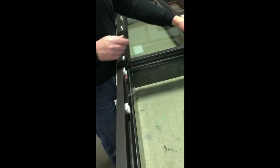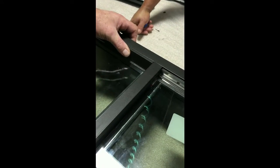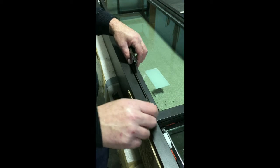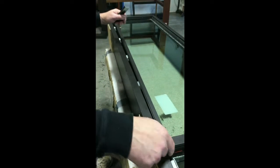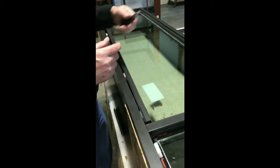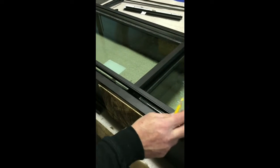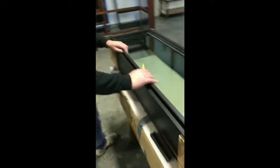This piece is going to go on there like that, and this piece is going to go on here like this. But one thing you've got to watch out for every once in a while is that the metal just overhangs a little bit. Because when I cut this to length, I'm going to be cutting it from metal to metal. So when it goes in, one side — the wood might be sticking out. Just kind of be aware. Make sure some of these end cuts are decent.